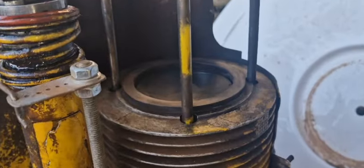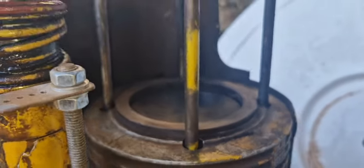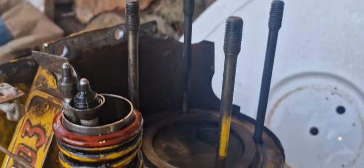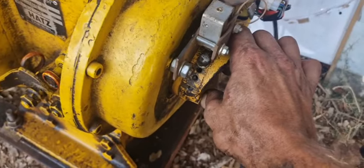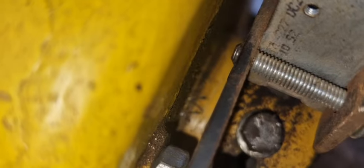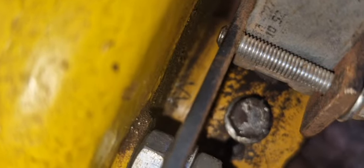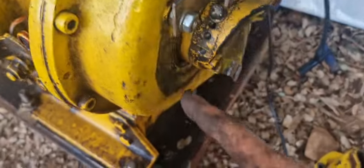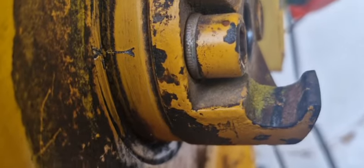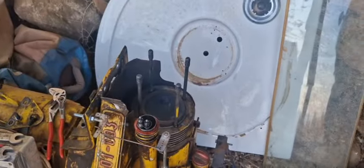Oh, one moment. So here it is when the spark starts, and then it should be here. Whenever it's aligned with it, then the flame is already here. And that's exactly when the piston starts to move down. So this should be the perfect ignition timing, in theory. I have made a little mark there in between those two things. There is the top dead center. So I'm going to mark that one on the side here too, so I know exactly what I'm doing here. Wait a second. So the mark is here now, exactly on top dead center. So now we can watch this with a strobe light whenever I get it running, and yeah.